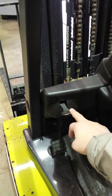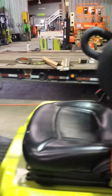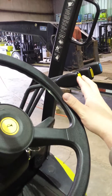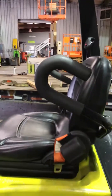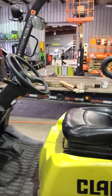We've got a kick plate style parking brake. As we can see the operator's compartment — this is the older Clark seat with the wings. The new one's got a different setup but we have the same hydraulic setup: one, two, and three levers — lift/lower, tilt back and forward, and side shift. The Clark has a full suspension seat for this model.